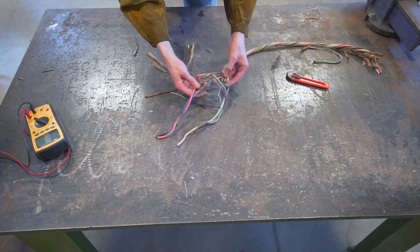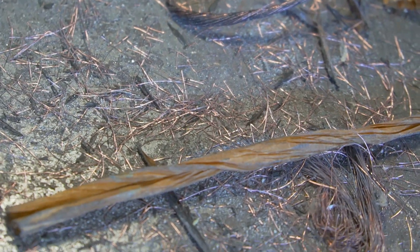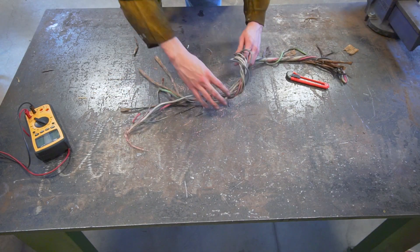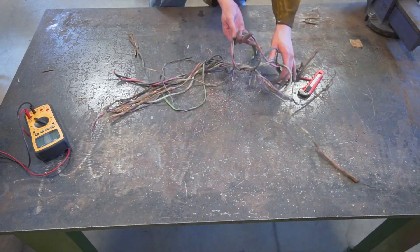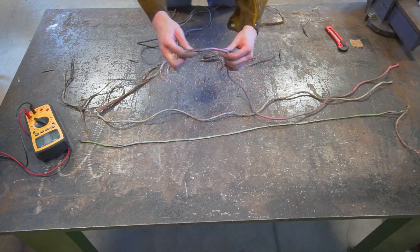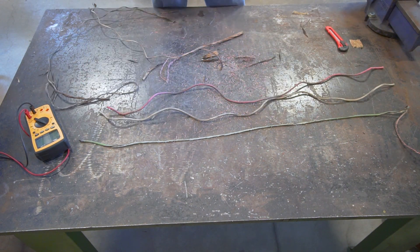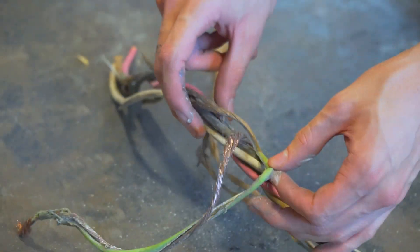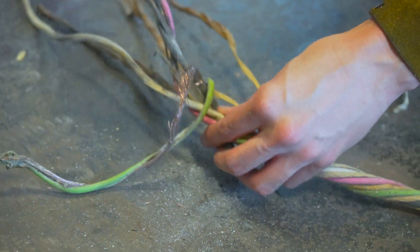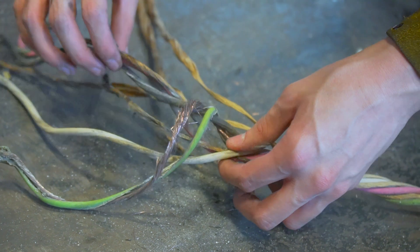This indicates that not only the grounding conductor has failed, but that the other conductors also suffered insulation failure and that the cord has shorted internally. Here you can see the sort of insulation melting and damages that can occur internally in a cord from the overcurrent test. There you can see.